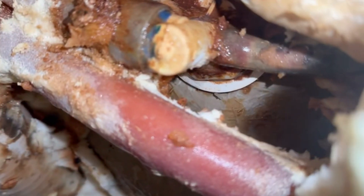Here's a video sent to me by a hot tub service technician showing a jet-to-shell leak in a hot tub. You can see the leak is a minor drip-drip kind of leak, and this leak in particular caused significant damage to the underside of the hot tub simply because it wasn't noticed right away. This is the weakness of the two-piece silicone sealed jets — at some point you are going to experience jet-to-shell leaks. And once they start, they will be constant. You may have one or two repaired, and then in a few months others will start to leak, and it becomes a never-ending cycle.